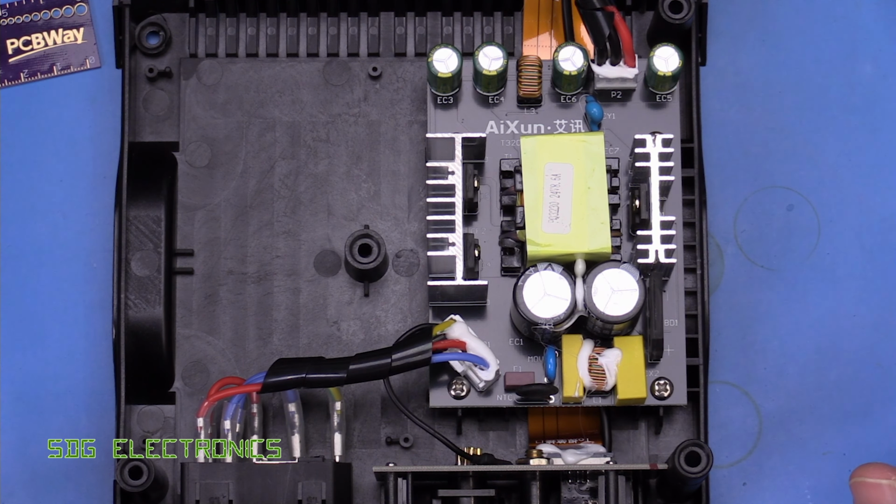It's fine to earth the tip of the soldering iron, but if all of the electronics is referenced to 0 volts here and the same as mains earth, then any voltage that you're trying to sense with the thermocouple is just going to get lost by shorting that connection. So I think we'll still have the same problem with this system. It doesn't exist on the T420D because we've got a proper transformer in that unit, but this one is going to have, unfortunately, that same problem.